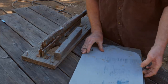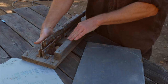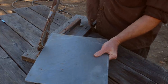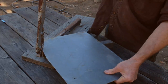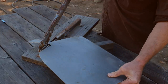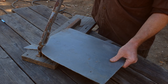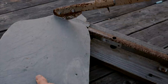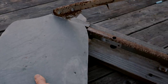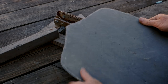This template is just a thin aluminum printing press plate. I screw it to the table and there's a little rest here. Using the slate cutter is really as simple as using a paper cutter - it's just a shear. You usually want to work towards the back of the blade. The blade is actually curved a little bit, which makes it possible to do some inside curves. For pointed areas you need to be a little careful, nibbling away at the inside curve a little bit at a time.